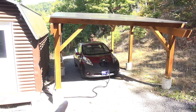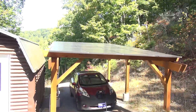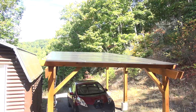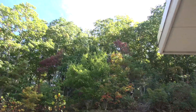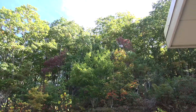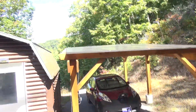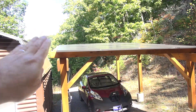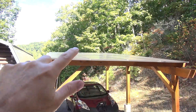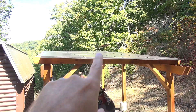There is the Nissan Leaf — it is busy charging. I've got a little charge station set up outside and I can plug in when I arrive. There is the solar array, bathed in light at the moment. We're at quarter to one and it's only just coming to full light. Because I sit in the lee of a hill the sun is only above the trees at around 12:30, and with the sun low in the sky I see a maximum of about 3,000 to 4,000 watts between 12:30 and about 3:30 in the afternoon.